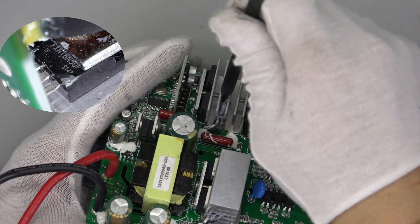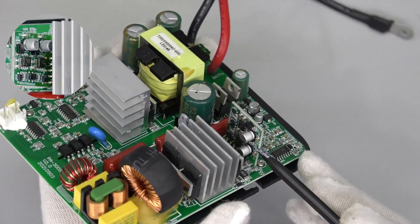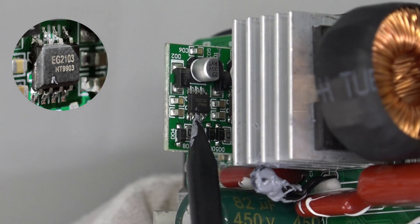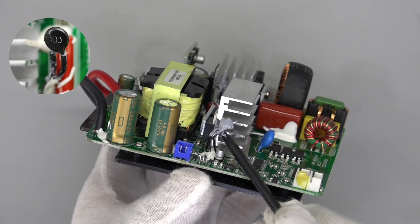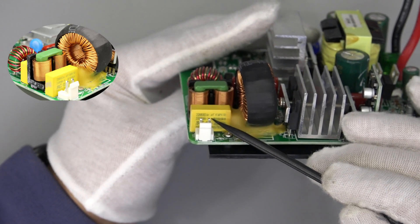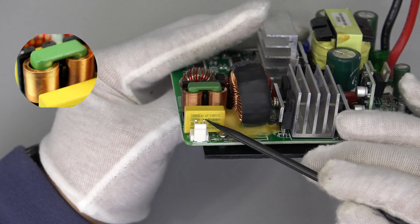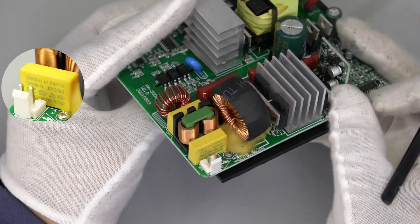The output DC is modulated by a full-bridge circuit composed of four MOSFETs fixed on the heatsink, from Fuxing Semi. There is also a vertical PCB with driver chips and filter capacitors soldered on it. Two EG micro drivers are used to drive the two upper transistors of the full bridge, in SO8 package, 600V 500kHz. A thermistor detects the temperature of the full-bridge MOSFETs. Here is the AC output filtering circuit — the red film capacitor is 1μF 630V, the blue-white capacitor is from Zonkas, the common-mode choke is wound with copper tape, and the safety capacitor is from Zonkas, 0.1μF.